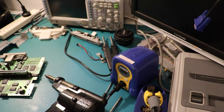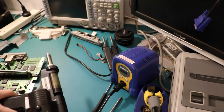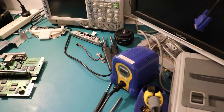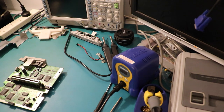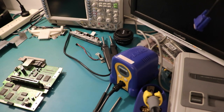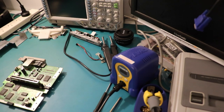I've missed that noise. Give that a minute or two to heat up. I think it's got the right tip. I have no idea though. So if you've got a Hakko 808, they're amazing. I'm glad I've got mine too, because they've actually replaced them. They've been superseded by a sort of yellow and blue one that doesn't look as nice and costs a lot, from what I remember seeing.